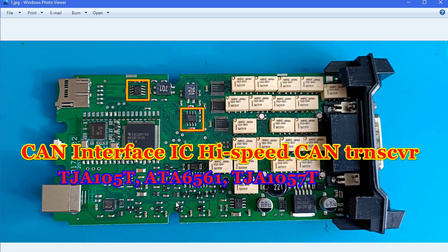We are now finished with the rework. After replacing these components, you should no longer have problems when trying to communicate with different car brands. I hope this video was useful and that you are now able to repair and rework this clone. I still get a lot of questions about Delphi not working or not communicating — now you know the answer: replace all the CAN interface chips and the voltage regulators. That's it for today. I hope you liked this video — see you in the next one, bye bye.